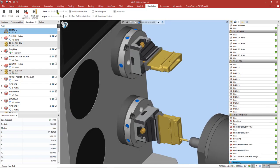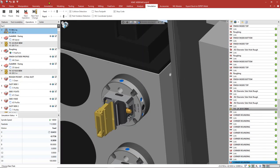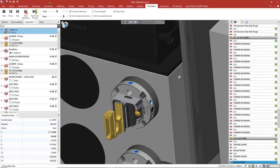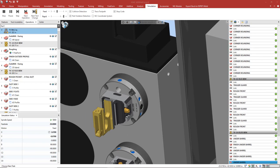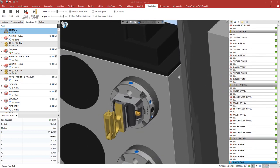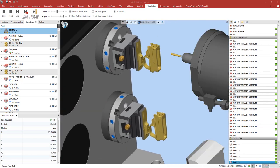This really shows the power of ESPRIT. This part started on a 5-axis Mazak Variaxis with one part. We changed the machine to an Okuma 4-axis horizontal, added the KME rotary tombstone, cut the single part, and then pasted it 4 times onto our new fixture. This required no reprogramming. Very impressive.